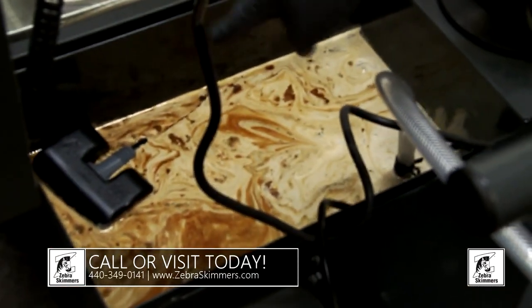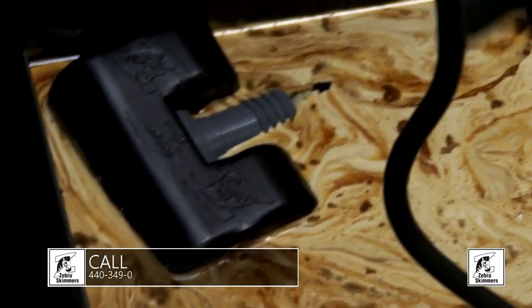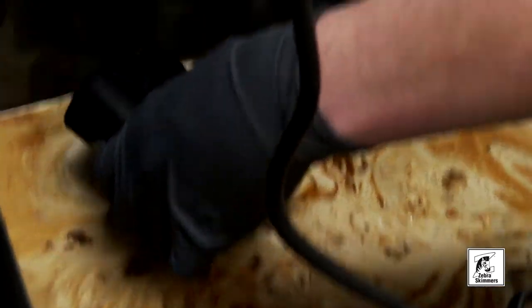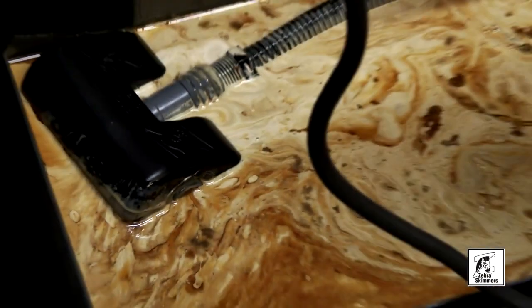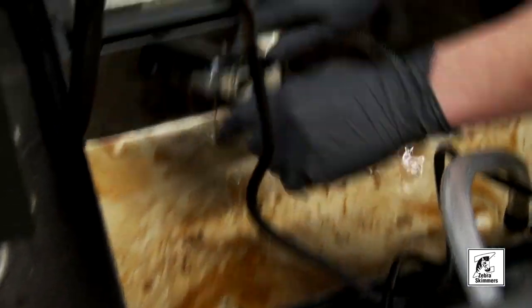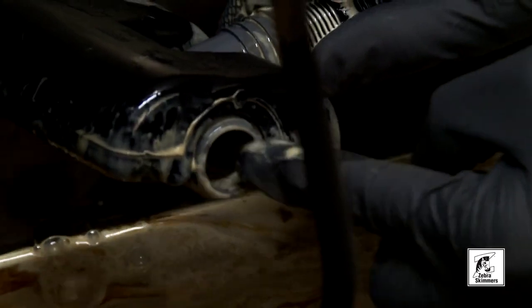For adjusting the hammerhead, you can see that it's submerged beneath the coolant — you don't want that, so adjust it by moving this back. Now you can see you have a little air pocket. You'll need to adjust this as your sump varies in height. You want it about half level on the hole — about halfway up. Make sure that this fitting remains somewhat loose.